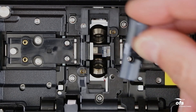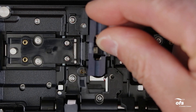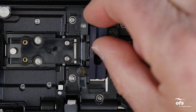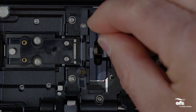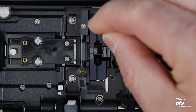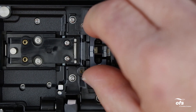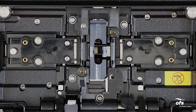Install the arc base with the left v-groove with the beveled edge orientated to the front and right of the machine. Push the beveled edge of the arc base against the locating pin, depressing the spring-loaded pin. The back of the arc base can now be pushed down against the main base. Releasing the arc base should reference the back edge of the arc base with the main base alignment edges.